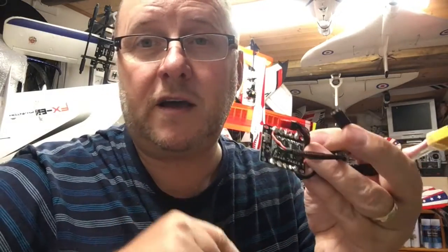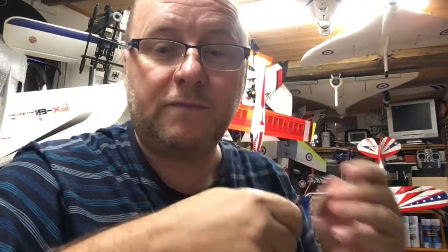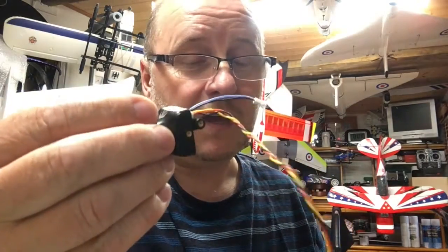So get your 12-volt plug on your power distribution board and build the quadcopter — leave the FPV to last. Get the quadcopter built and then do the FPV. But before you plug the battery in, make sure that all the wires are correct — there's never a black going into a red. Check the wires all the way through to the camera; you don't want to break one of these £37 cameras. It's easily done.